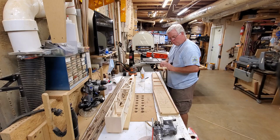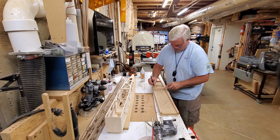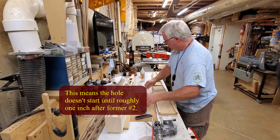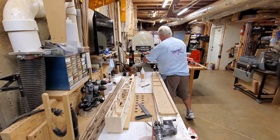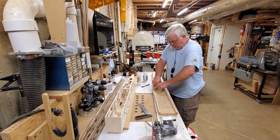All right, and remember this is where that last former is here, and we want to come past that former so that we can make the bend, right? So we want to give ourselves enough room to make that bend. And let's come off of it probably an inch or so. So let's measure that. Let's give ourselves an inch off of that former to make the bend. Should give us plenty of room to get past that